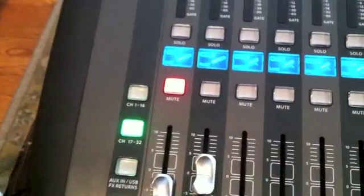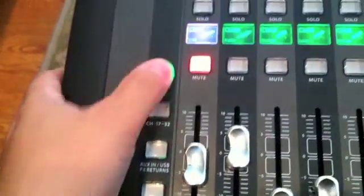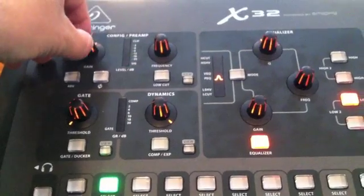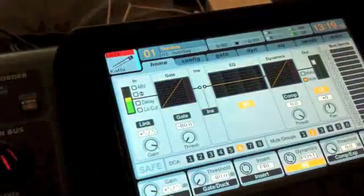So now we have got this plugged in. I had done my channel before and so I am plugged in on Cathy's on channel 18. I pressed the second encoder there to go ahead and get her all set up. Go ahead and put it on mute, and what you want to do is as you start talking — if you look towards the top, I am talking near the microphone now — the gain is engaging so you start to spin that up and you see it is starting to light up a little bit more. In fact, it shows up on your main page there too on the left-hand side.